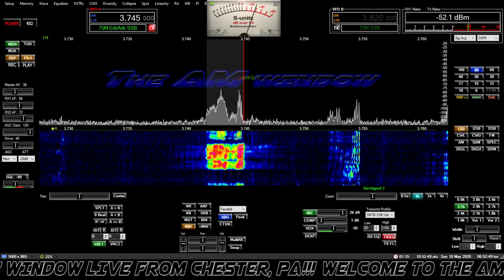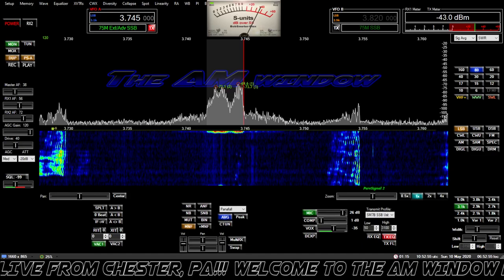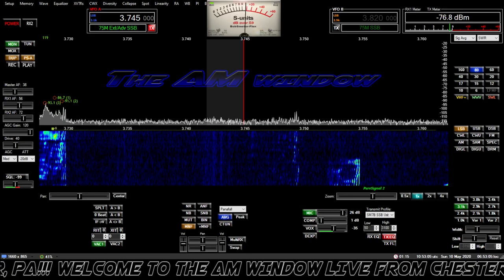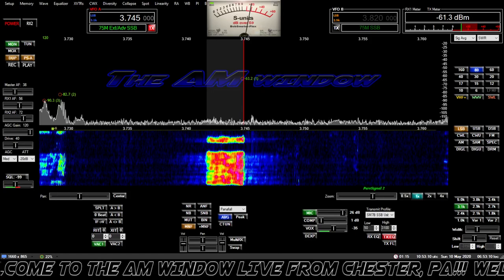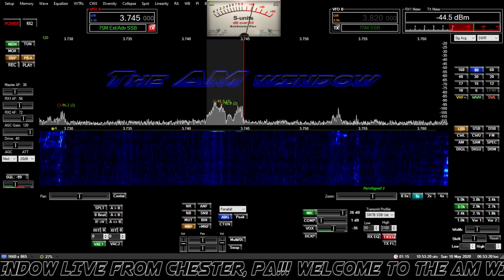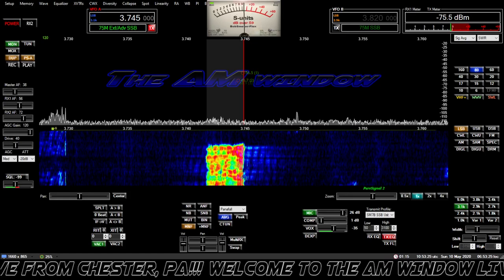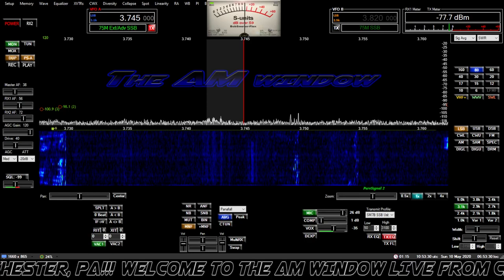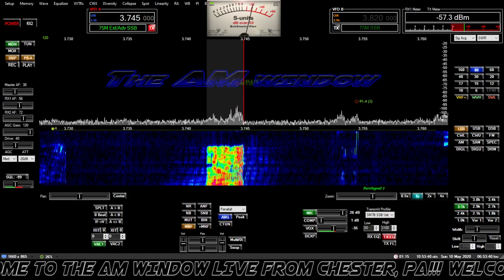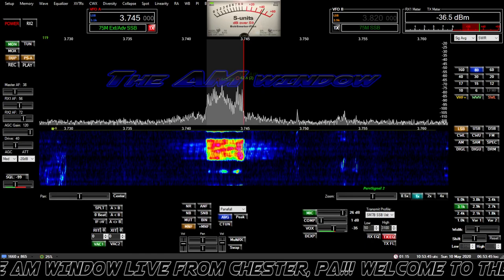Hey, you've got a good ear, too. I never ran it on Class A. I thought that was kind of a gimmick, to be honest with you. The Dynaco amplifier runs on Class A, though. I think all the Dynacos did, didn't they, Brian? Anyway, the thing gets roaring hot, even if there's no signal going through it. Watch your amp meter on your rig, Glenn, when you have it in Class A. Put the meter on amps. Every time you key the mic, it's full amperage, whether you're talking or not.